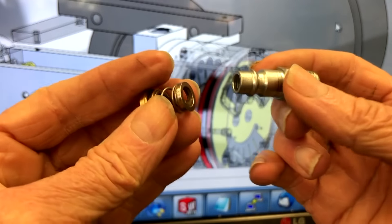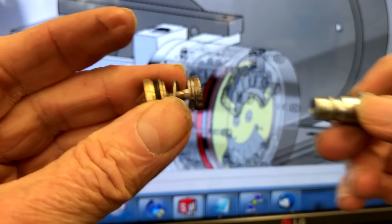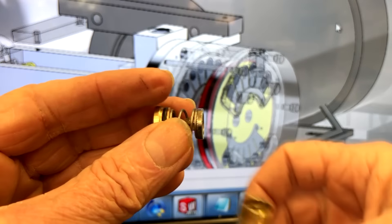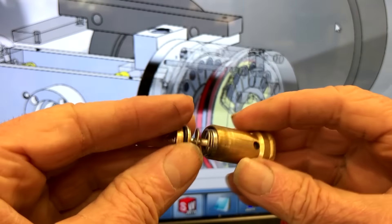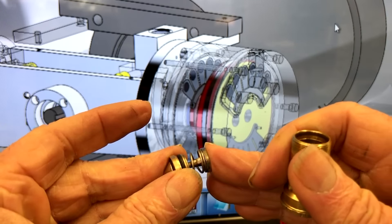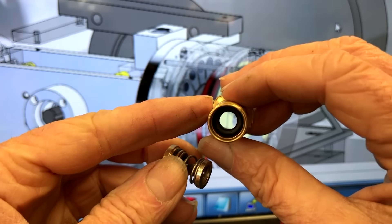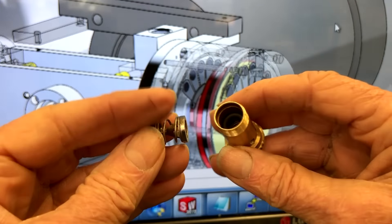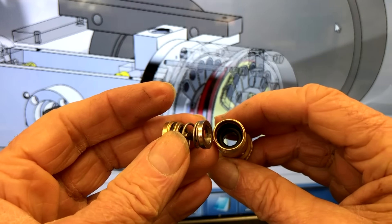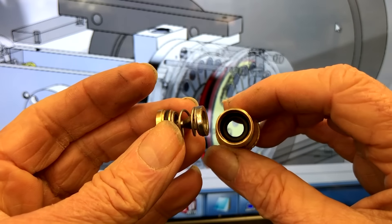The interesting thing about this, which I find rather bizarre — I can't believe how puzzled I am by how it can be that bad. The o-ring in here is what's interesting. Inside here, what pushes against this poppet is nothing but the o-ring, and the o-ring is riding in this bore. This bore is half-inch diameter. So what that means is that the air pressure coming in is pressing against this full aperture of one half inch — unnecessarily so, I might add.